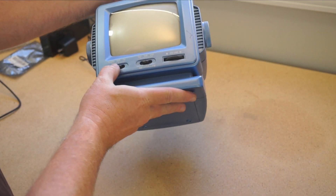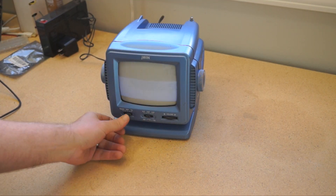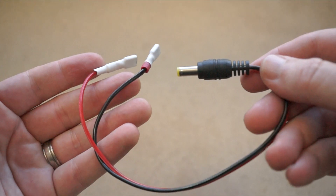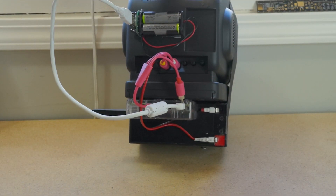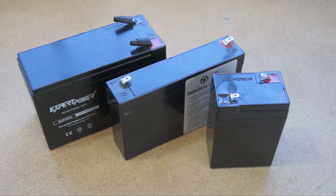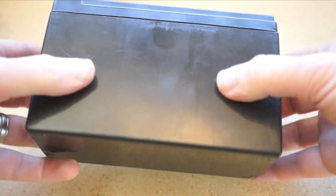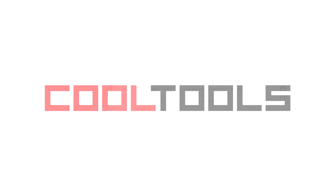As another example, I had a portable cathode ray TV that took 8 C-cell batteries or a 12-volt AC adapter. So I just wired a barrel jack cable with crimp spade connectors and glued the battery to the bottom of the TV along with a Raspberry Pi that auto-plays videos. It's a little chunky, but it's portable and rechargeable. So that's a look at SLA batteries — they're heavy, but they're cheap, durable, rechargeable, and easy to hack for stuff that runs on 12 volts DC. You can pick one up using the link in the description and see thousands of reader-recommended tools like this at cool-tools.org.